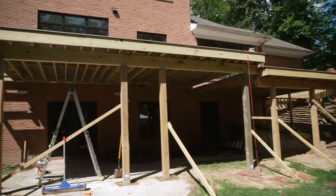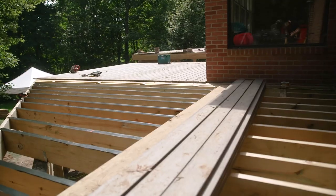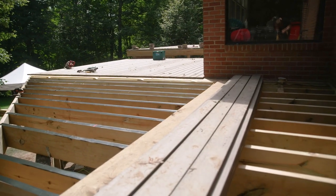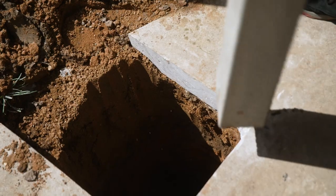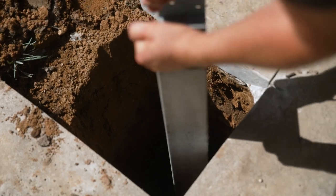Taking a look at this job behind me, what we have here is a very large project. About five days ago we got the old deck demoed — it was a very small 12 by 12. We got rid of that, dug our holes, the inspector showed up, and we were able to put the PermaColumns in after lunch and start framing that afternoon.